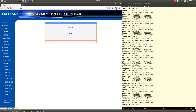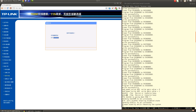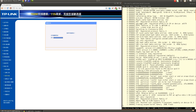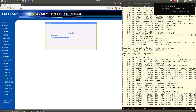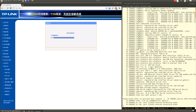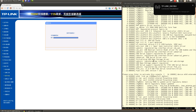Once flashing completes, the device reboots. We can see U-Boot starting our Linduino Linux kernel. During boot there's a window to press 'F' and Enter to enter failsafe mode via the serial console, or you can press the reset button with a pin while the LED is flashing. This failsafe mode is very convenient if you've misconfigured things and need to restore a working system.